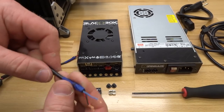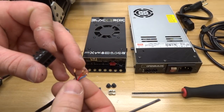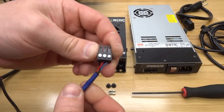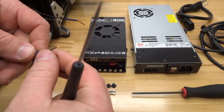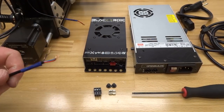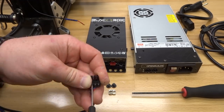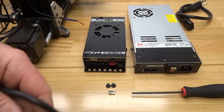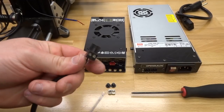Next, take the power cable that came with the power supply and locate one end. Loosen each pin on top to prep it for the LED light ring wire. On the power supply side, white is positive and black is ground; for the LED light ring, red is positive and black is ground. Twist the positive wires together and the negative wires together. In the 2-pin connector, positive on the right and negative on the left — insert those wires and tighten down the pins. Make sure those are nice and tight; you don't want this connection coming loose.